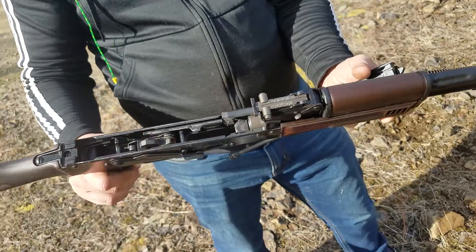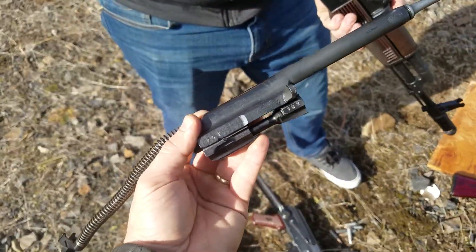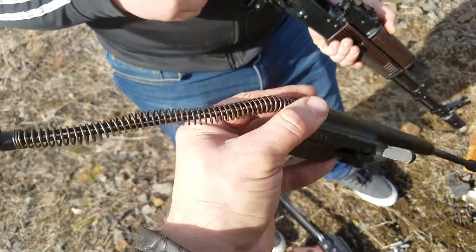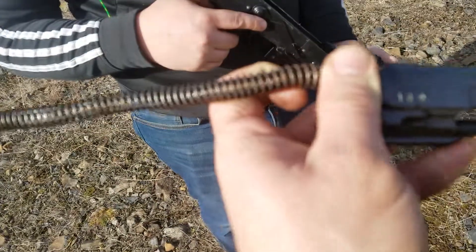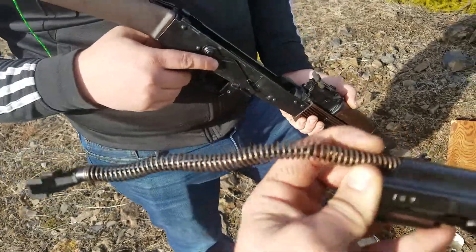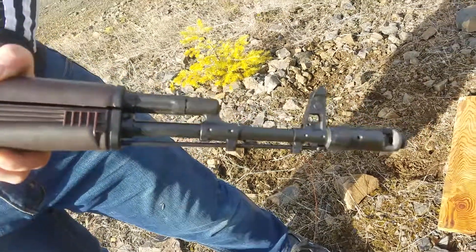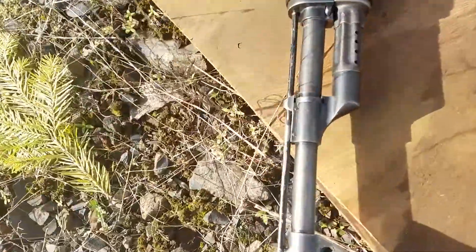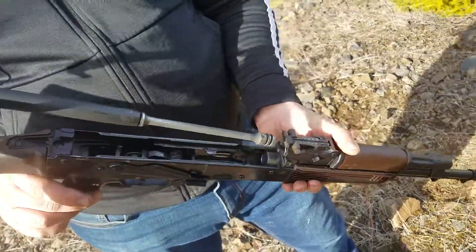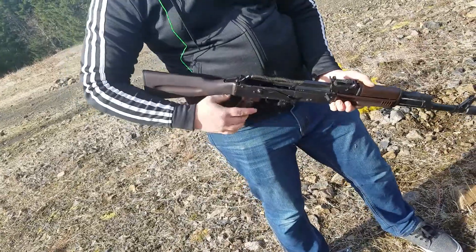Double wound hammer spring. Show me the bolt carrier group. There are lightning cuts that make it lighter. Besides being a different caliber, the AKMs follow the same principle. The recoil spring, as you can see, has two pieces of wire that are looped back and forth, assembled together. A lot of pieces are cast on here. This is a 1987, but this isn't even pinned in place like the pieces on the AK-47 — it's just dimpled in with a die. We were able to reproduce that over at Z-Guns. It just goes to show you two completely different generations of AK — very similar in function, but completely different manufacturing.